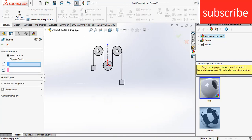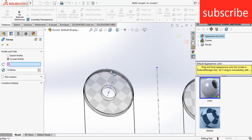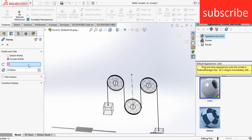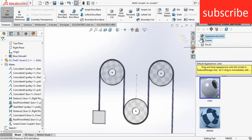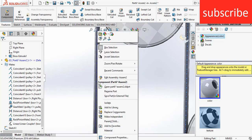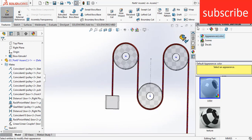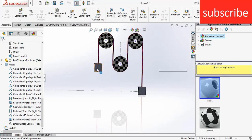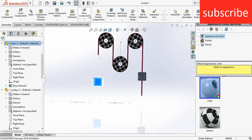Click on features, click on swept cut, click on circular profile. Make sure the diameter is 10 mm, because the groove I cut earlier was 10 mm. Select this, click OK. Give it an appearance — right-click, click on appearances, click on part, select the red color or any color per your requirement. Click exit the sketch. Now when you move it upward and click on rebuild, you can see it's moving great.